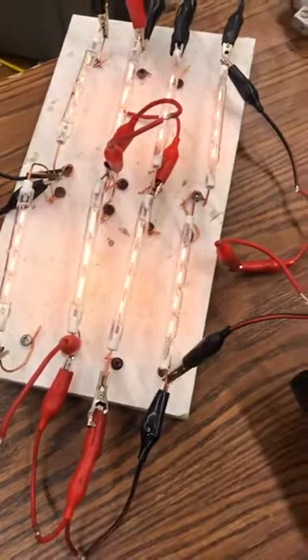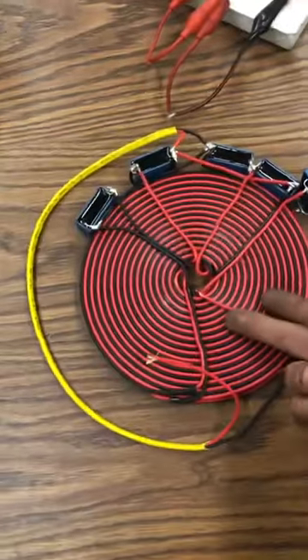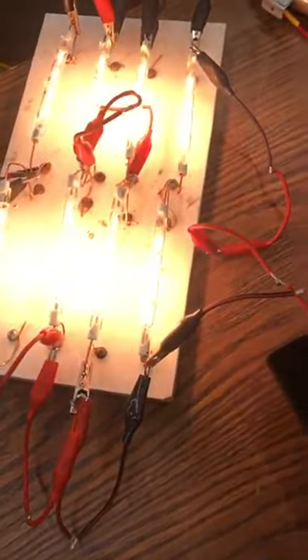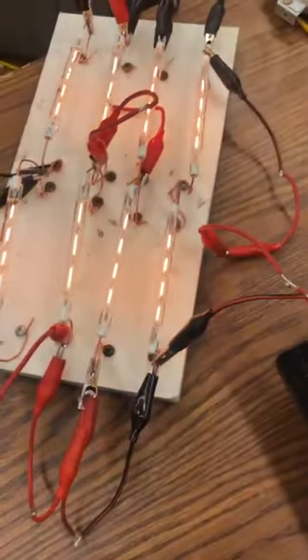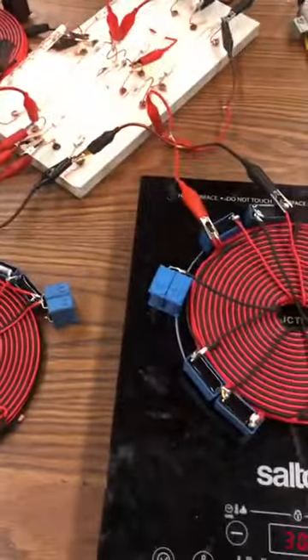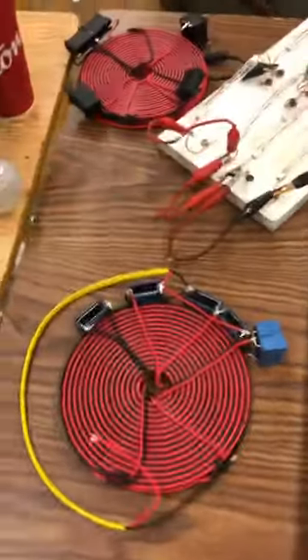Right now, if you count this up at a thousand watts, I have 16 amps at 240 volts flowing through those bulbs — that's why this coil gets warm. Same with this one. When I step that down to 110 volts, that's 32 amps. That's serious, serious power.